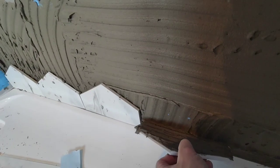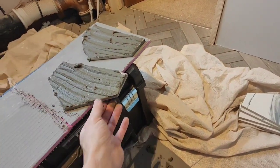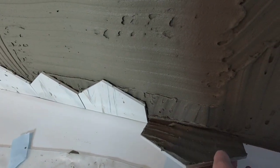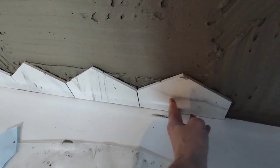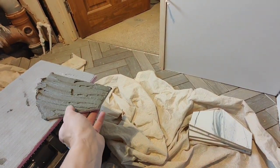On the other floor — the herringbone floor — I only put the spread on the floor because it was nice and flat and I knew I could get a good bond. With these herringbones, if you double butter them like this, it all squirts into the joint and then you're basically just cleaning up joints on every single one, and there's a lot of them.